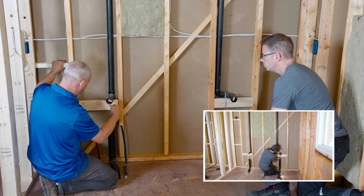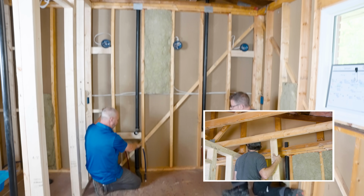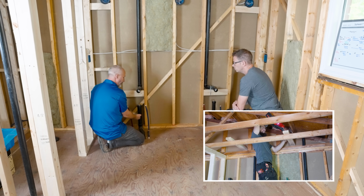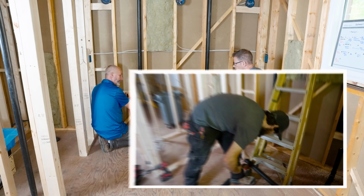Now you've got, this is venting, right? Both of those are venting. They tie up in the attic. Yep. P-trap's going to be inside the vanity. Correct. So when we go to install the cabinetry, we'll have a base. They can cut this pipe a little bit above it, bring it up, P-trap, tie together into the venting. That's it. That's after the cabinet goes in. Correct. All right.